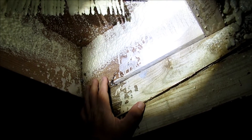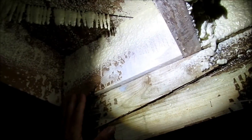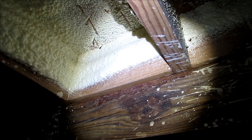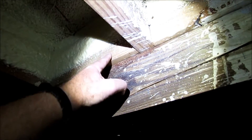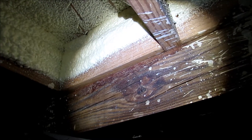If you have a crawl space and you're thinking about putting foam insulation in it, just know that there are some termite companies that may not write a policy as a result of this. You need to check with them before you do this, but the general rule is if they have about a two-inch inspectable window in case they need to come in and inspect for termites. I did leave that inspectable area along the rim joist.